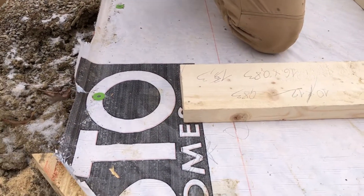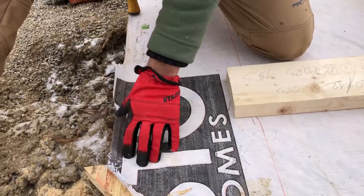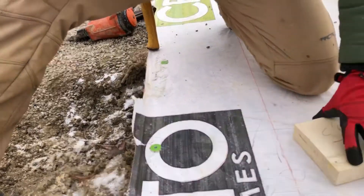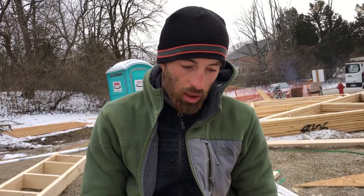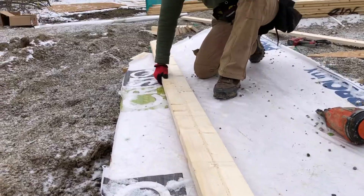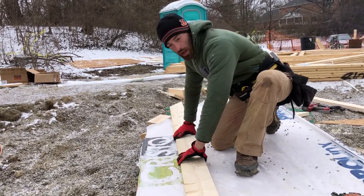So if I had a one-foot chicken ladder I'd use method number 2 because it's faster and easier. Method number 1 is nice because we can find both the location of the chicken ladder and also the length of the rafter. Now I'm going to show you the next step: we have a pre-cut piece of 2x6.